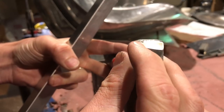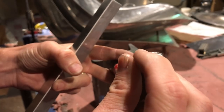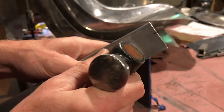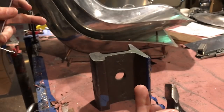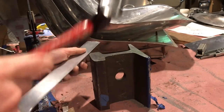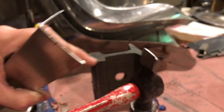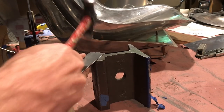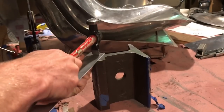This is going to be a little bit tricky to use because it has kind of an arc to it, and really I want it to be flat across to get a really nice square blow to the aluminum when I'm hitting it — and that's going to create the linear stretch that we're talking about. This isn't going to work as well as it should. I've actually rounded this for using it for a couple different things, but I have a different way of doing linear stretching that I'm going to show you in a moment. Just for the sake of giving you an example, let's go ahead and show you how this would be done by hitting this aluminum on this side.